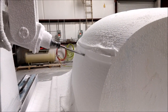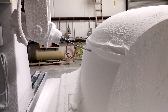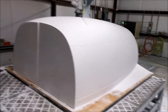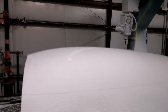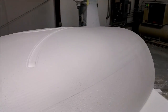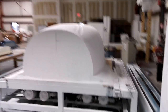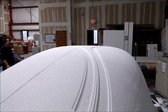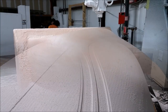This is the cabin, finishing off the right-hand side. I split it into upper and lower — it made it easier to run the passes because I had to use the long bit on the sides and the short bit on the top. There'll be pencil traces cut in the finished plug which translate onto the part so we can see where cuts need to be made for windows. From the rear you can see how the parachute straps come back into where the engine compartment will be — they came out really nicely.